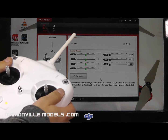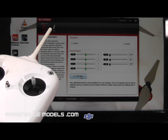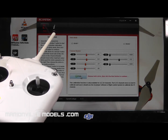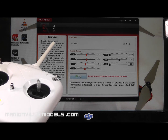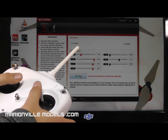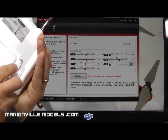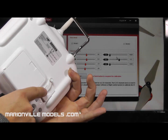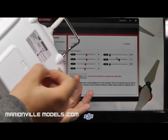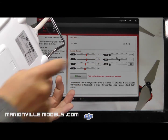Really all we're doing here is a calibration. Click on the calibration button. It's different from the Phantom Assistant — you have to click it twice. When you click it, it will come up and tell you what to do, but you need to press Next to actually get it to work. Then just calibrate your sticks in a circular motion. Another important one is the trim lever on the back. This is very important to do — a lot of people that have Phantom tilting gimbal problems, like on the new 3-axis gimbal, is usually because this has not been calibrated in the NAZA Assistant software.